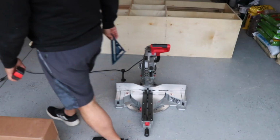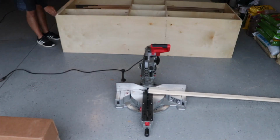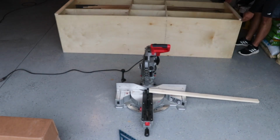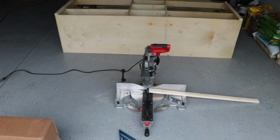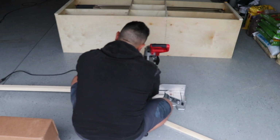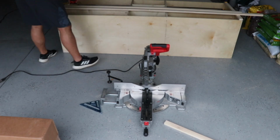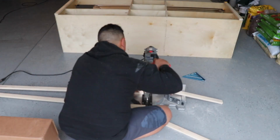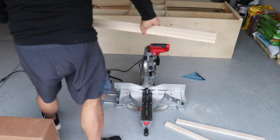I think that was a big part of it. I was supposed to dado that bottom panel so that my center two vertical walls were inset a quarter inch. So it ended up being a quarter inch too high, which ended up I just dadoed the top brace instead. So yeah, when you are going to make changes, or you know, I like to wing it a lot of times, just know that it could cause you a little bit of headache as you move forward through the project.